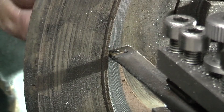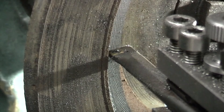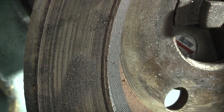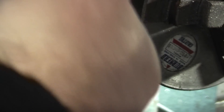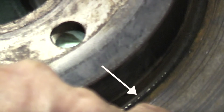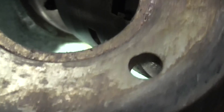I can see from the back here it's just coming through, so that means the cast iron is very thin on the lip. So I'm going to take it off — the last thing I want is for this outside part to be falling all over the lathe. If I look on here you can see where it's shining at the bottom there, that's where it's cut through. I should be able to tap that with a hammer.